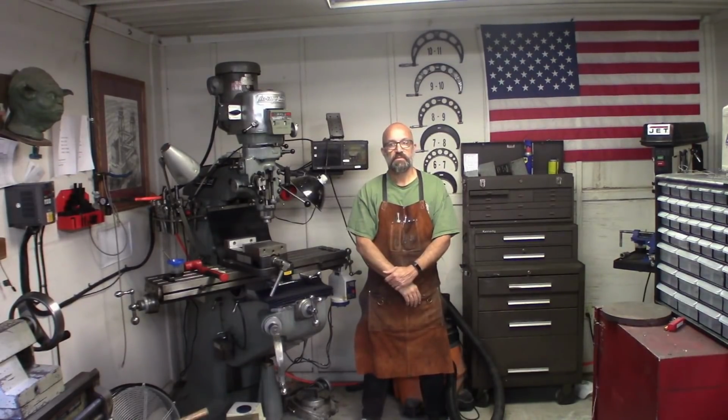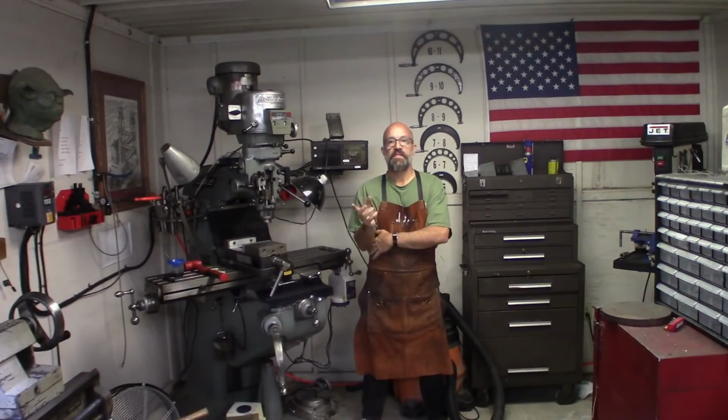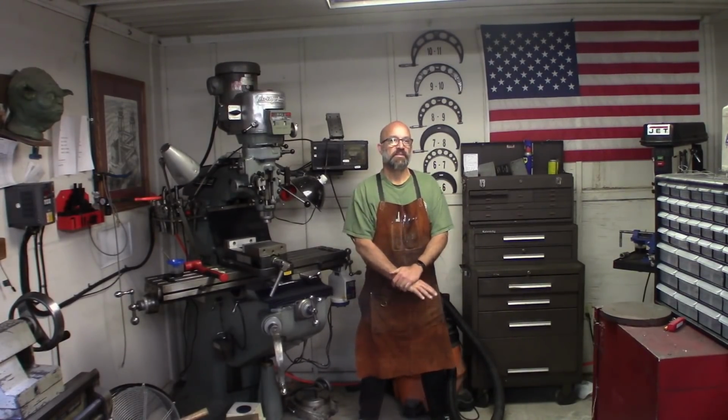Hooked up the trailer, got it, brought it home, and started reviewing different schematics and different videos online, going through a lot of information, just trying to get a full grasp on it. Plus just going over what was in there, what existed, and how it was wired. I got it figured out, and then I started putting things together. I figured out how to do the contactors, getting everything so it would start and stop, adding a little bit of safety to it so that if you lose power, it doesn't come back on afterwards. It's a relatively simple switch, but it's not intuitive if you're not used to working with switches.